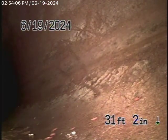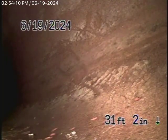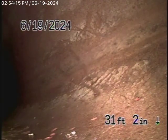We had a quick look underneath the house. There were no mainline cleanouts over there, and we can see ABS plastic, but I doubt it was really done by a plumber. You'll want to check that out with a plumber or the general inspector. There was no cleanout underneath the house.